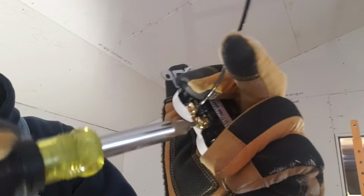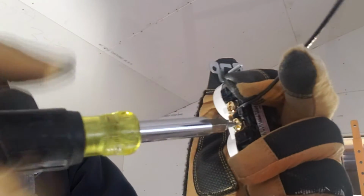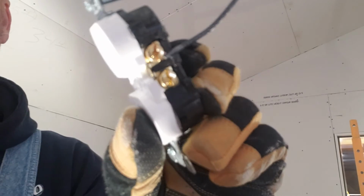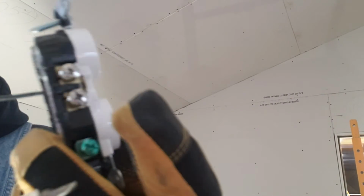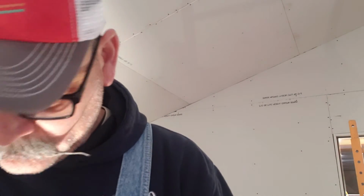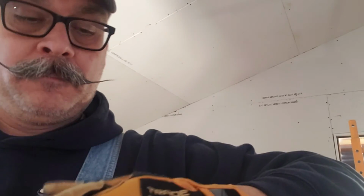Okay, so that's just 1 wire. And the other screw, I always just tighten up a little by hand. Don't over tighten it, but just so that it's out of the way when I put it in the box. And we'll repeat the process for the screws on the other side, neutral and ground. That's it. Make a good connection.